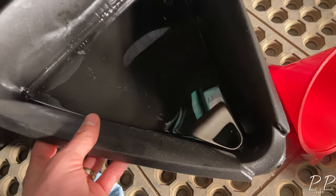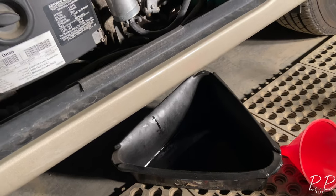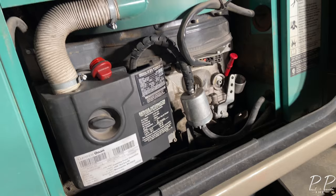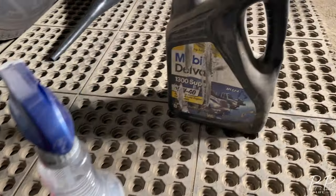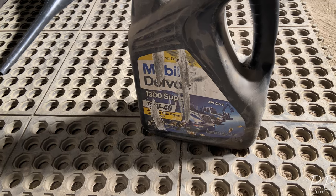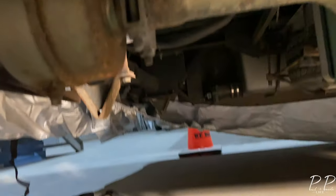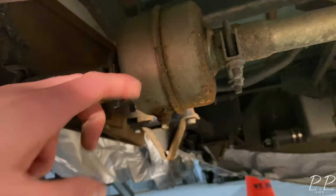Now I'm going to measure this out to see exactly how much oil came out. The manual says every 250 hours you need to do this service — I usually do it once a year. I'm going to be putting in some 15W-40 diesel oil. Another thing I'm going to do is clean the spark arrestor on the exhaust, so I'll get a clip of that.